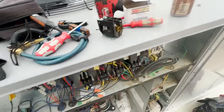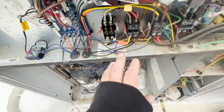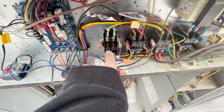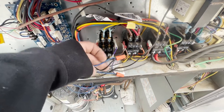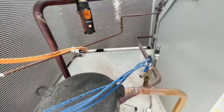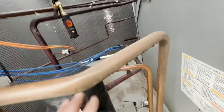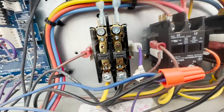We'll see if a new contactor is going to work. With this low-ambient strategy and a three-phase motor, we have two of the legs being broken by this contactor. The contactor is triggered by 24 volts, and that 24 volts is interrupted by two pressure switches in parallel. Either compressor can ask for the fan via either switch — whichever one closes will send the voltage over and close this contactor.